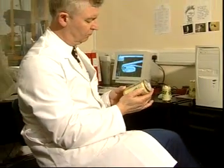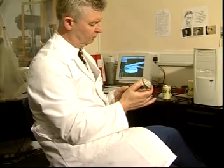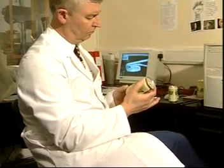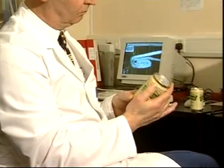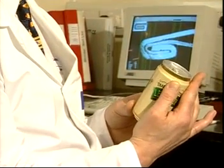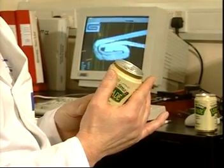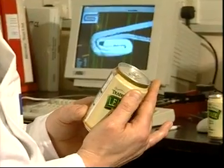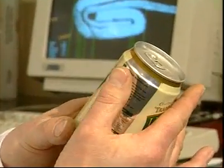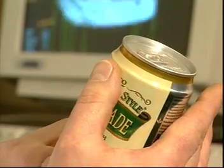Visual inspection of the double seams should always be carried out. This is the only way to quickly establish signs of early tooling wear, gross misadjustment, or damage to the seamer tooling, for example cracked or broken chuck. Rotating the can whilst inspecting the bottom of the seam and the outside of the can will allow any cut or crack in the metal, including slivers or fine hairs, to be observed.